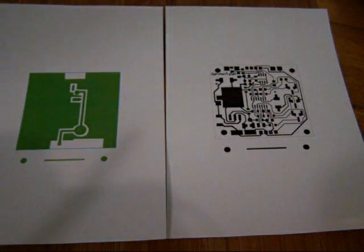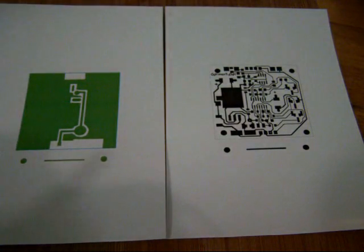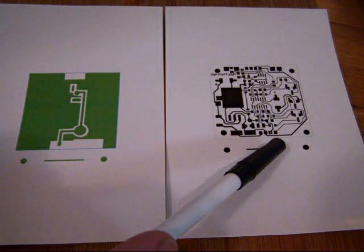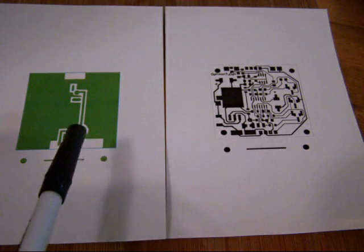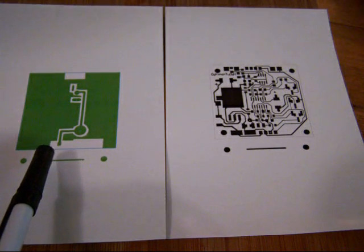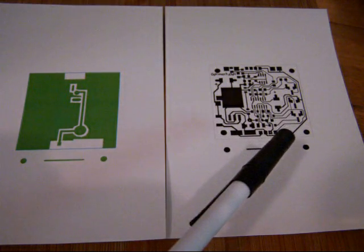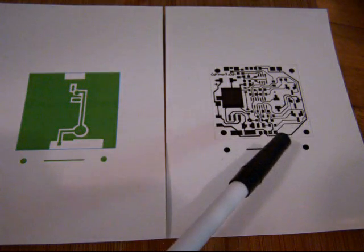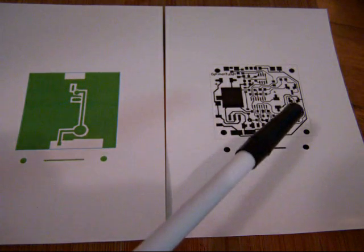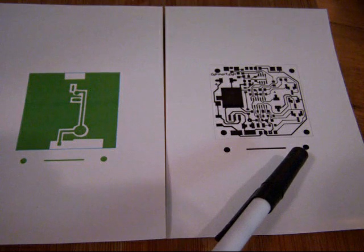The correct way to add your masking to your copper clad board. I have here a reversed mirror image of my primary top side, and here is a positive of the back side of the board. In this case, I had to run a special print driver to create a PDF for the reverse mirror. I will be providing a PDF already reversed, so all you have to do is print it out on this special paper.